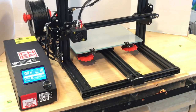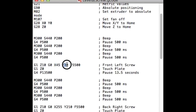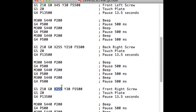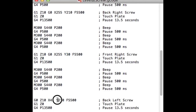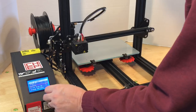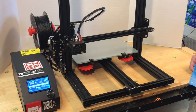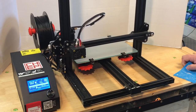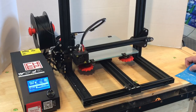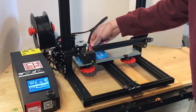So that's how it works. Now what I actually wanted this thing to do was to land on top of the screw heads, not the corners. So I went into the file and I modified the X and Y positions to go on top of the screw heads where the adjustments actually are. These are the adjustments I made and once that was done I left everything else alone. I saved this as a new file called level-at-screws and ran that. It's basically the same thing — it homes itself and then instead of going just inside the glass like he did, it goes right on top of the screws where the adjustment nuts and springs are. Here's the first one — you can see it goes a lot further in, but I like to have it there because that's really where I'm adjusting it.